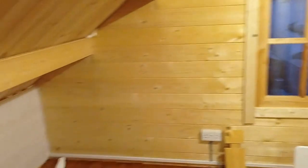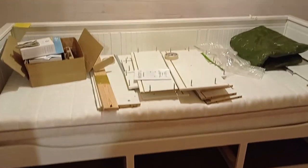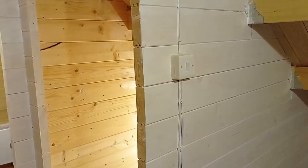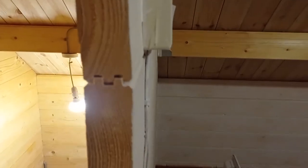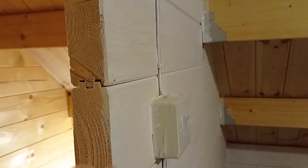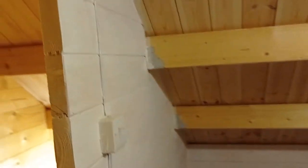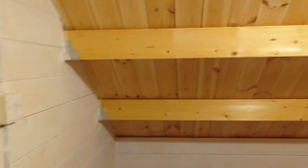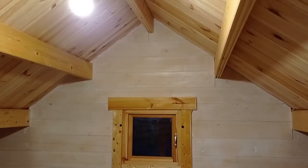We're just going to do that wall there. I've done this wall and this wall, and as you can see in this room as well — looking nice. We've had to move the bed out into the middle, but I have done all four walls here in the undercoat. It's taken a while because I can't use a roller — it goes in between each log so it's not a flat surface. I've needed the brush to get into those grooves, and it's not worth switching between brush and roller, especially because it's quite fiddly around the rafters. It's also quite stodgy paint, which makes sense because it's for wood — it's to stop it absorbing too much into the wall. But yes, that is the undercoat done.